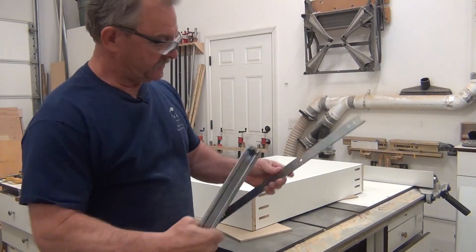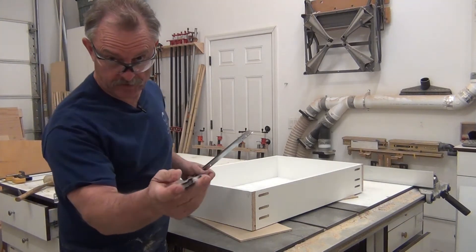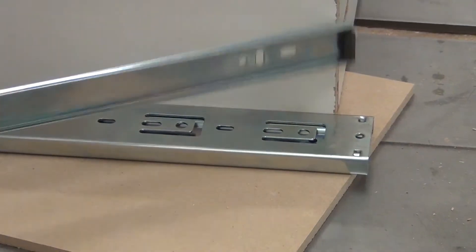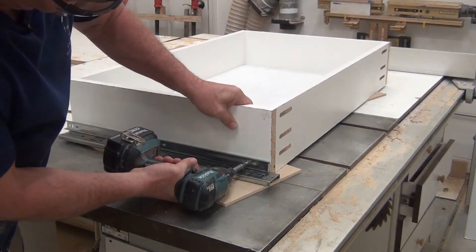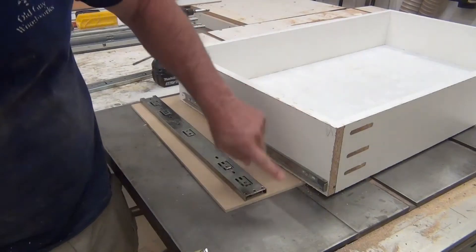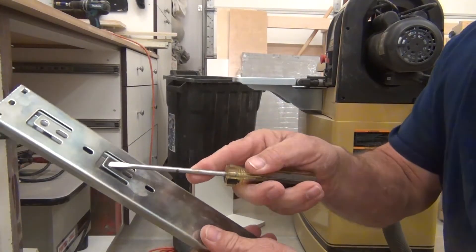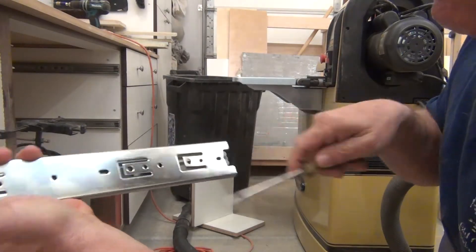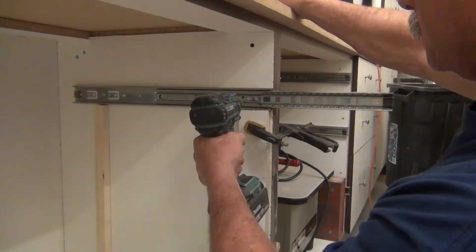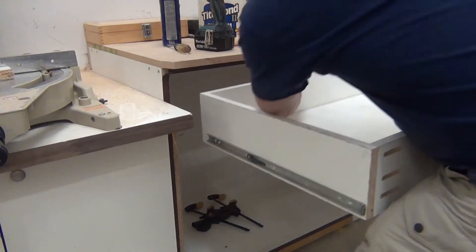When I go to install, I take my slide and I like to have it just up off the bottom of the box. I use the actual width or depth of the slide to determine my height, so when it's installed the slide will be flush with the bottom of the drawer. I take a measurement of the drawer to find out where I need to install it in the box. Bending these tabs ensures a tight fit. I use the measurement of the drawer to make blocks to hold the slide in place, then simply screw it in — you could buy a fancy jig, but I'd rather use my scrap.